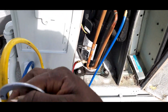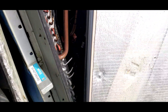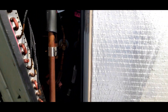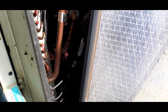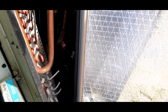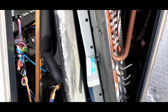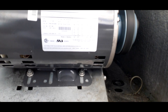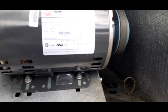What are the chances both stages are low on gas? Could be the TXV, but what are the chances of both TXVs going bad at the same time? That's very rare. So I don't think it's the TXV. Could be low gas — not really sure at this point.